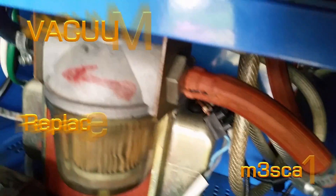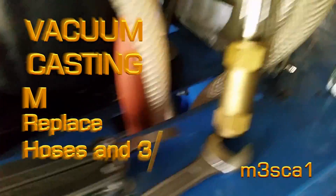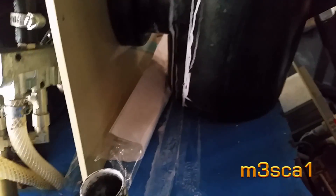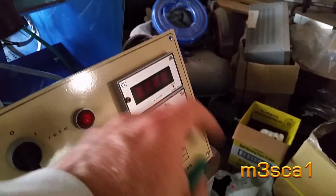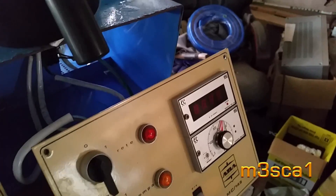Hello tubers, Mezcal here. This is just another update on the repair and running of this vacuum casting machine. I had it up to temp to melt some silver yesterday and all went well. It definitely needed to be switched to full power instead of preheat because it wouldn't get up to 900 — it was sitting around 400.